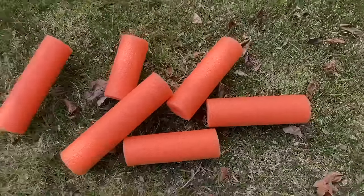After finding the center on the side piece and the length board, line them up and then secure. Once everything is square, measure your final 4 boards to make a hollow rectangle. Cut and secure these as you did the side squares. Finally, attach 2 eye hooks to either side to use for hanging. After my eye hooks were secure, I attached 3 feet of black chain link to each side of my chandelier.